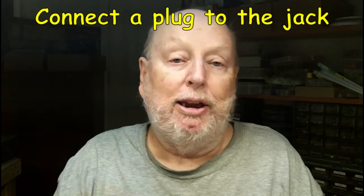I will put a link in the description for the jack that we used for this, and this is a switched jack. For those who don't know what that is: it means that if there is nothing plugged into the jack, the circuit is completed internally — it would be just as if there was no jack there at all. As soon as you plug into it, it takes the input from that jack, disconnects you from the original source, and we go from there. Bob is going to explain that better, but let's get on to his explanation and then we will come back with a look at the boombox itself.